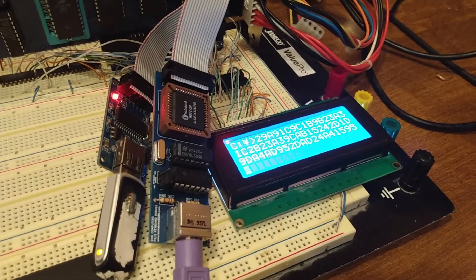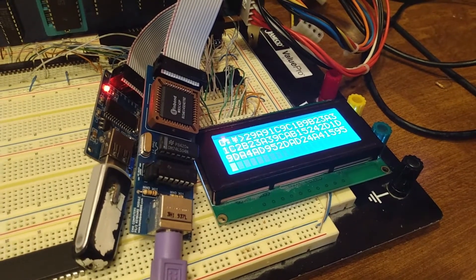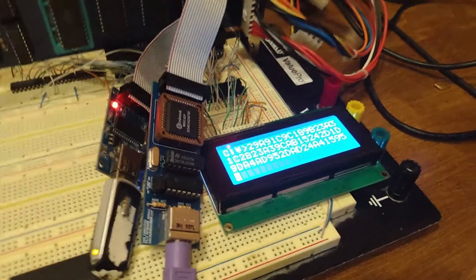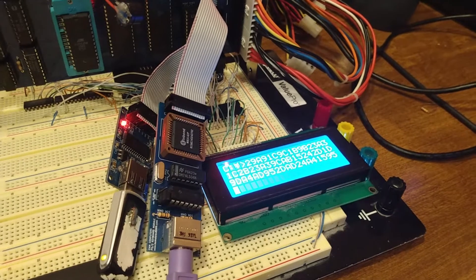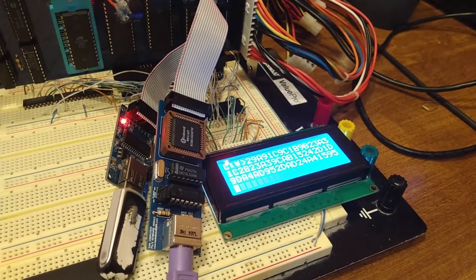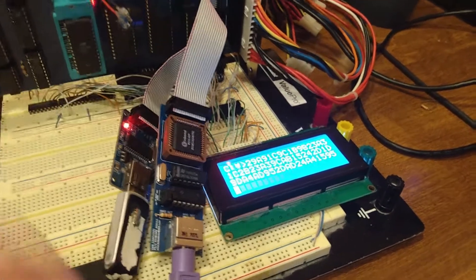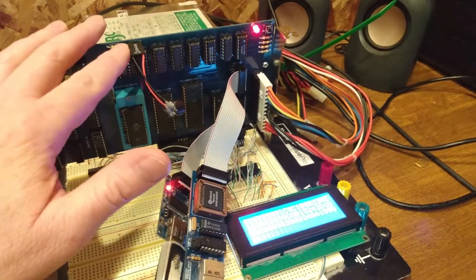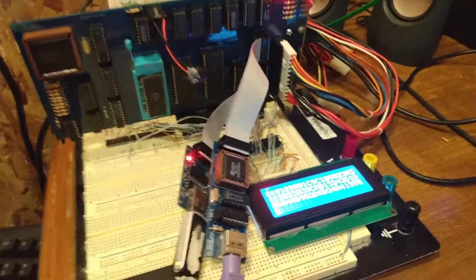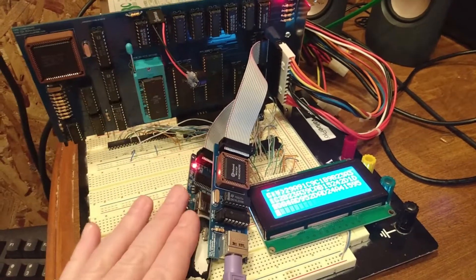And then DOS will take it from there. I've got enough familiarity with DOS programming from my other projects — once I add that to the keyboard buffer and tell it there's a key in there, DOS will take off, and you could start typing commands. I've booted this up with the auto-exec to load a game like Paratrooper, Digger, or AlleyCat. And sure enough, right here on the speaker it'll play the theme song to AlleyCat flawlessly. Obviously there's no screen, so you can't see it being played, but it plays just fine. So we know the speaker works, the hard drive works, and the keyboard works.